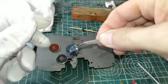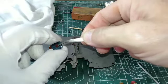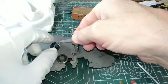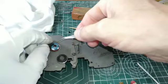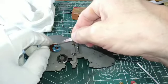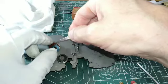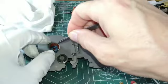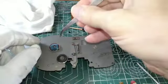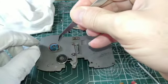And to adjust it, if the take-up is slipping, also make your adjustments by bending it, just like that. Okay. Put this on just like so. You want to make sure that you center this with the brown disc. It's a little irritating to put on. Okay, in other words, you want brown showing all the way around here when you put this leaf spring on.